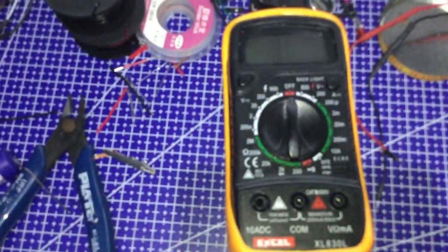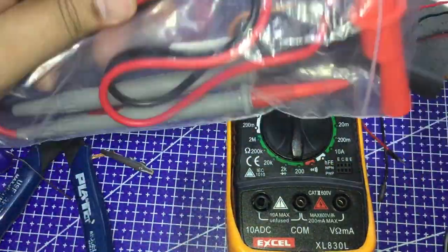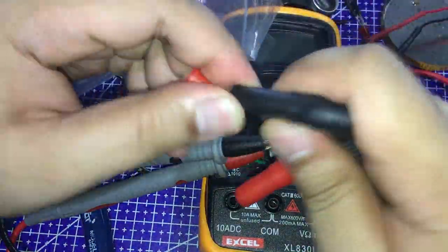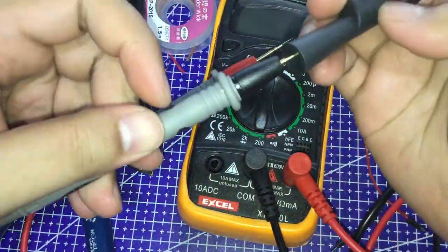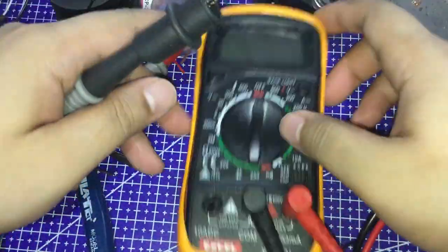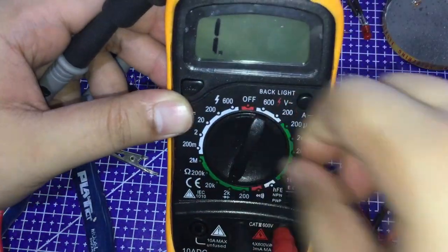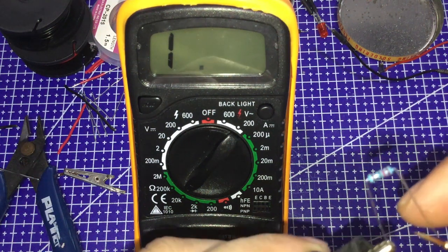After soldering the MCU to the PCB, let's solder the resistors. We need to make sure that we are soldering the right resistors on the right terminals. We will need a 220 ohms resistor for the red LED, 330 ohms resistor for the green LED, and 10k ohms for the float switch. Oh, by the way, I'm using a multimeter to know the resistance because unfortunately, I don't know how to read them by just looking at the colors.